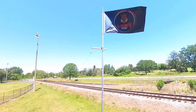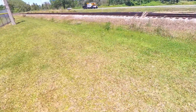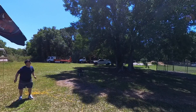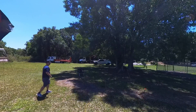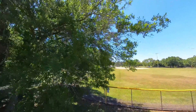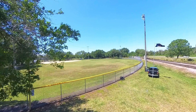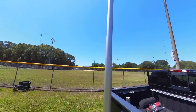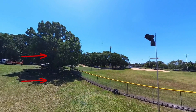With this type of inverted V setup you can achieve ground wave communication and broadband medium to long range bi-directional sky wave broadside to the antenna. My ground spike is right below this tree branch holding my micro with the wire attached. I need to get that sliding polymer ring on the rest of the wire and pull the wire up into the tree to create an inverted L configuration — a broadband short to medium range antenna that tends to be unidirectional towards the end of the horizontal part of the antenna, so you could deploy this if you were trying to create some directionality.